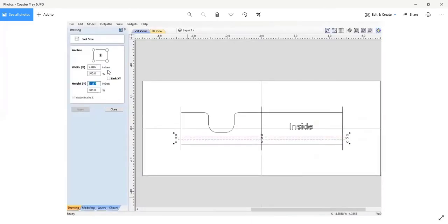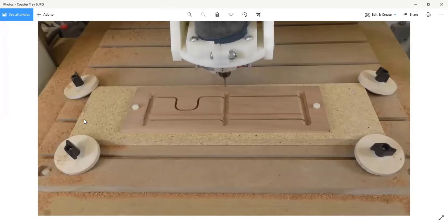So what I show you is we take this press board, which could be MDF, could be anything. It's just scrap. Lock it down to the table, and then I use the holes that you saw in that drawing on each end for drilling a 3/8 hole, which we then put a threaded brass insert into. The threaded brass insert holds the nylon bolt heads that you see on both sides of this piece of cherry. That's what locates the part. So the first step is we take the blank of cherry and use the CNC to cut the 2 holes, and then those get bolted onto this fixture board.